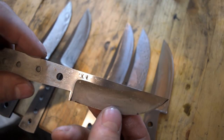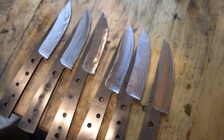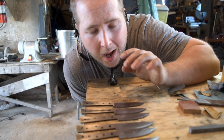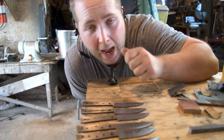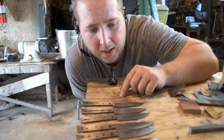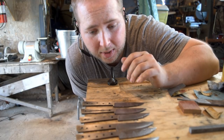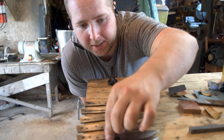That way I know exactly how good my edges are. By putting on my finished edge before I do handles, I'll be able to do some minor testing on the blade — run them through some wood, do a little hacking, some whittling and carving, and see how the edge holds up. Is the edge rolling? Is it dulling really easily? Then I know we have a problem. I haven't yet had an issue, but that's our next step.